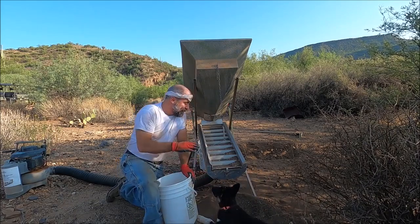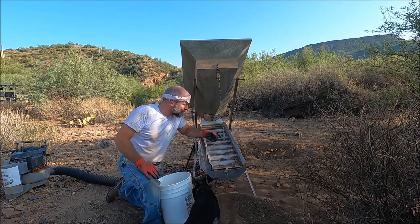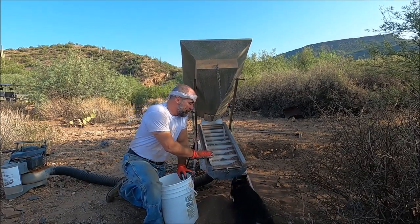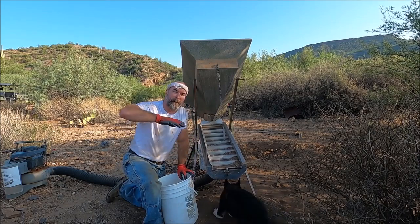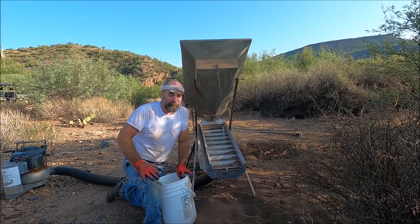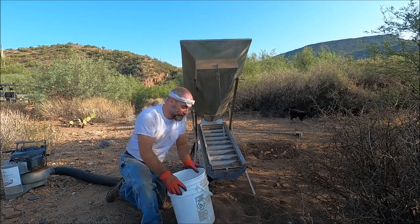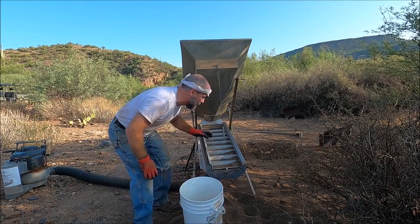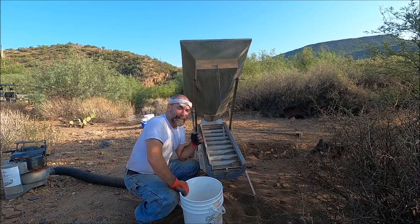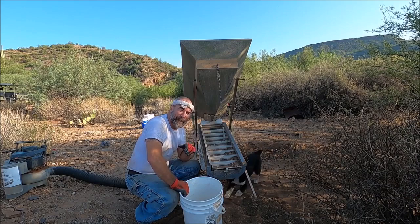Good boy. Now, I shut down, and the reason why I did is because I pay attention to my dry washer. I've done this a long time, and I'm noticing my vibration is slowing down in the box. Generally what that means is you're getting a lot of heavies, sometimes a lot of lead, sometimes a lot of buckshot. So what I'm gonna do is empty this out, and I'll do this probably at least 6, 7 times. And then at the end of the day, I'll run it back through at least 3 to 4 times. And that'll give me my concentrates that I take home.